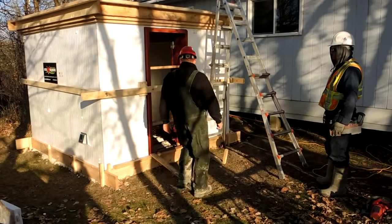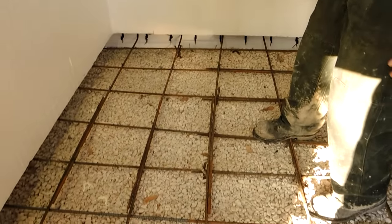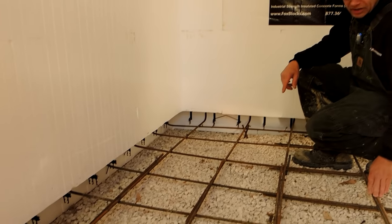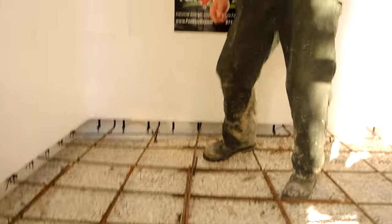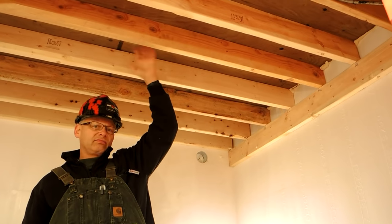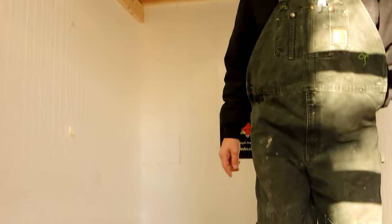Come take a look inside here. We've got rebar at a 12-inch grid on the floor. We actually cut up 8 inches and wrapped it down, so the outside has the block — we just cut the block in half basically on the inside face and cut that off. Up top, these joists are temporary, just put one foot on center with some pressure-treated plywood above it. That pressure-treated plywood is going to stay there — we'll hammer some nails through it into the wet concrete, and when we rip the forms out later, the plywood will stay there as the ceiling.